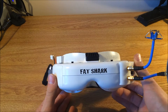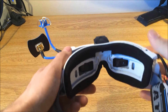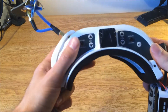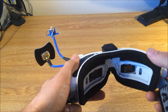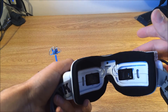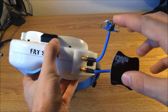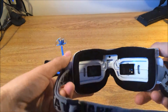The way I'm gonna be viewing my video is through a pair of Fat Shark goggles. These are the Fat Shark HD2s. They no longer make this model, but there's plenty of other good ones out there. These have a lot of cool functions, one of them being head tracking. So when you turn these goggles, they can sense which direction you're turning them, and then can send that information to your gimbal on your quadrocopter, and your quadrocopter's gimbal will turn the way you're turning the goggles — so it's almost like you're right there. They also have a really cool recording feature so you can record the video being seen in the goggles. You can also buy a diversity setup so you can use two antennas to receive information from your quadrocopter, which gives much better video quality. They're just all around a great pair of goggles.